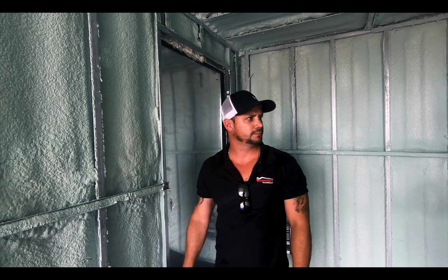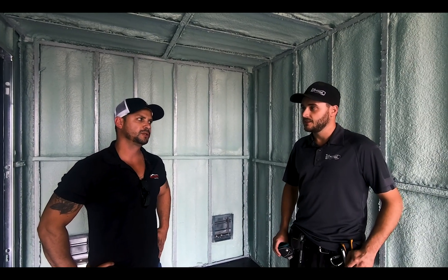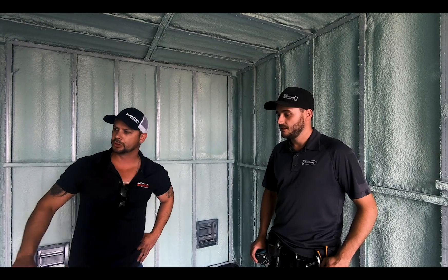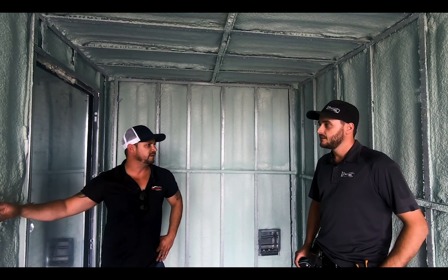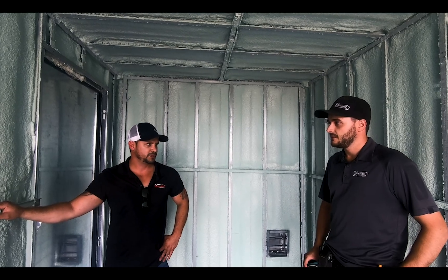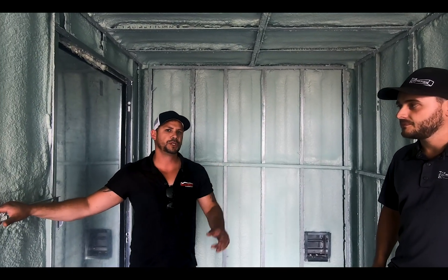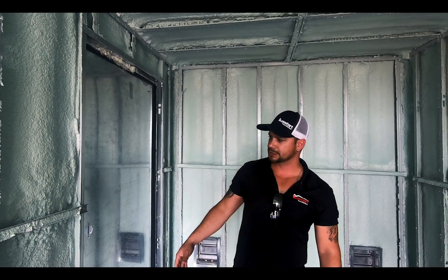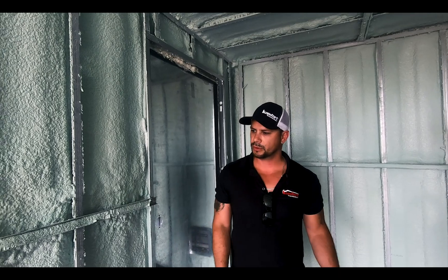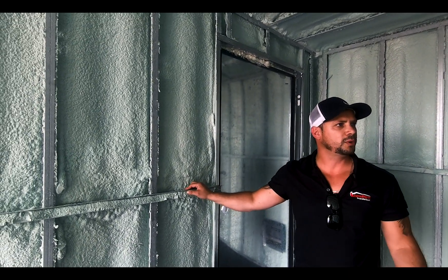That condensation with fiberglass insulation — that could lead to health problems? Tons of problems. Metal conducts tons of thermal. So when you actually try to put regular fiberglass, what you're doing is creating a gap inside and obviously future issues. In this way, as you can see, there is nothing in between, so all you need to do is just put drywall on top.